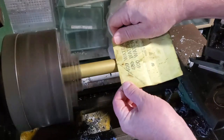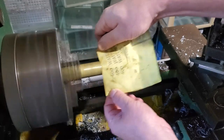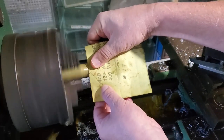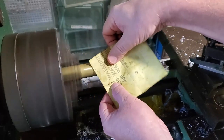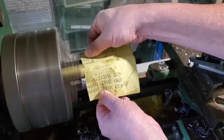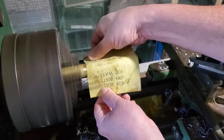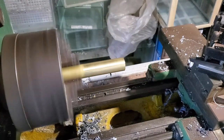I chose this tube here — this is going to be one of the two main cylinders. It is a one-inch external diameter brass tube with a one-eighth inch wall. Part of the reason I chose this is because the solid rod I already have in stock is one inch in diameter, and I didn't really want to go buying more solid rod because it's very expensive. It's also one inch diameter so it has a lot of volume, and I want to move a lot of air here.